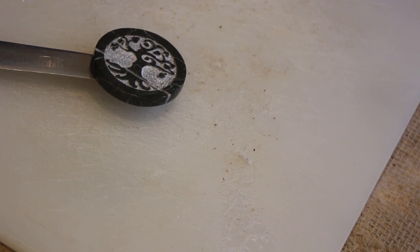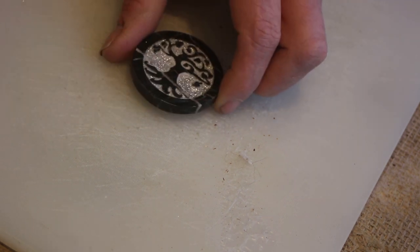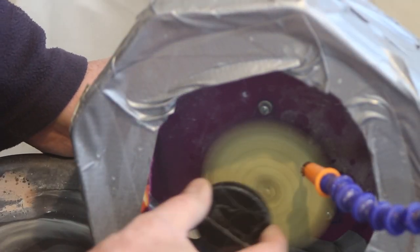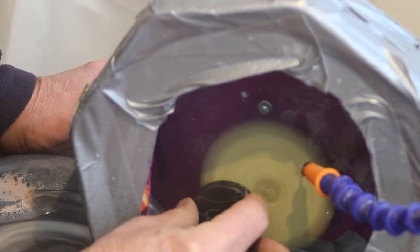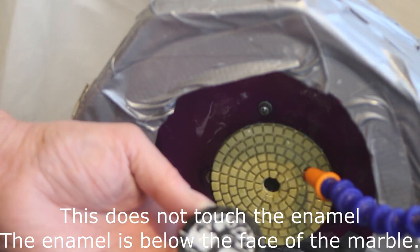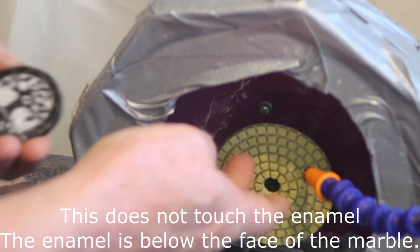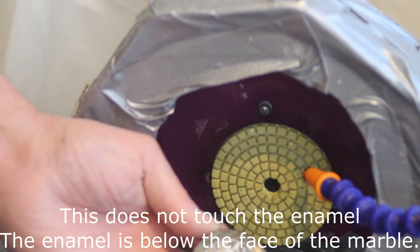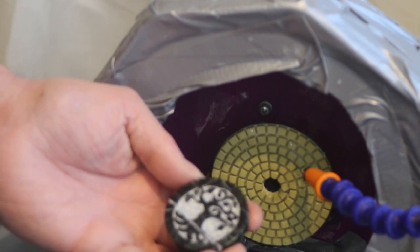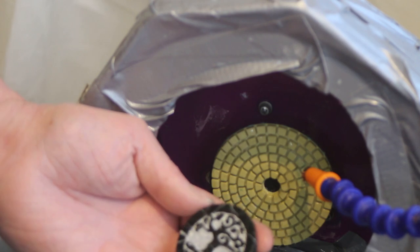It's still reasonably warm. Now I'm just going to let that cool right down. The EF Colour, although it's called a cold enamel, is actually a resin. I'm going to let that harden off, which will happen as it cools. So I decided to polish it off using the final stage at 2000 grit, which is really fine for marble. And it's given it a lovely shine on the surface and cleaned it off perfectly — it hasn't affected the enamel at all. And that looks a really nice job, I think.